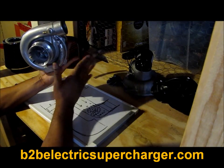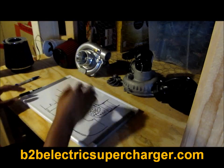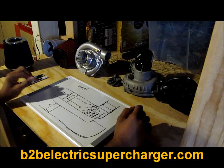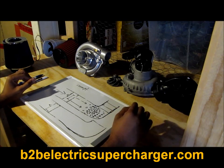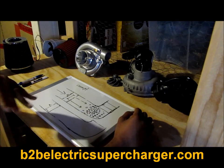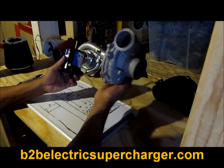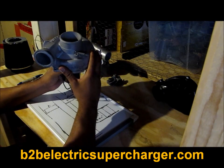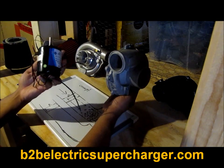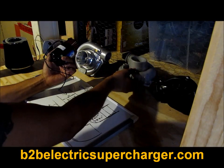If you guys have any questions, hit me up through YouTube or go to the website and check out the blog. I actually have two blogs — one on the website and another one, links will be posted. The blogs are really helpful because they break down impeller speed, battery usage, and battery amperage to help you understand why you're not going to get 6 PSI of boost from something like XS Turbos running at only 9 amps with an impeller speed of 13,000 RPM.